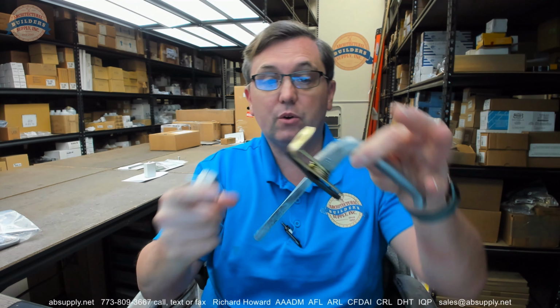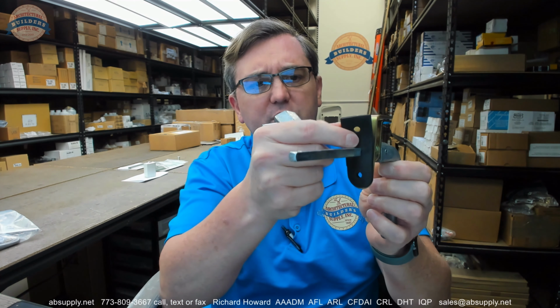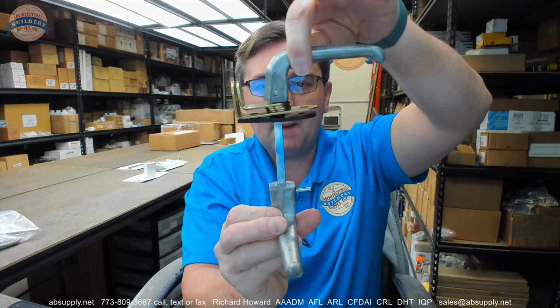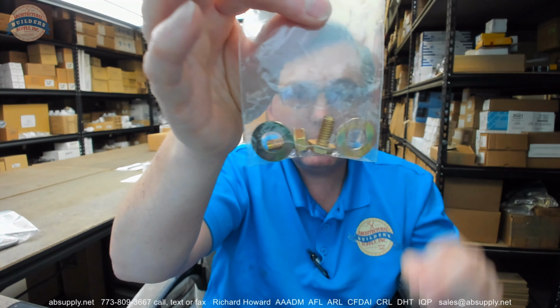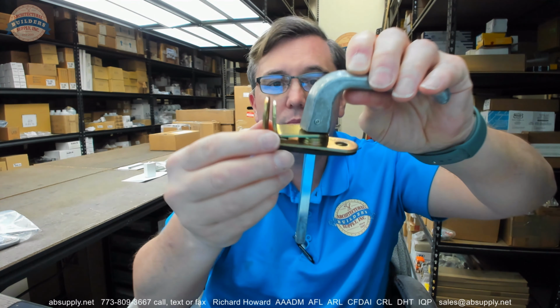What would be the exterior handle assembly that you can padlock. This would go through the exterior door. You have your neoprene gasket here, which is available as a separate product, by the way. This will go through your lock body. Then your handle will come in from the opposite side, okay? And you will get a couple of fasteners for this. You'll notice one has a thinner head and the other has a standard head. The thin head will go underneath this area here. The standard head will go back here, okay?